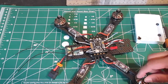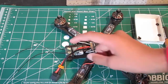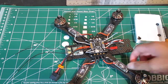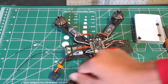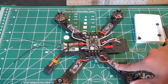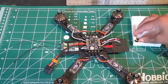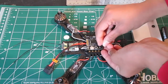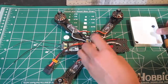I also heat-shrank my ESCs. I tested them using my receiver — I bound it using a separate power source from the ESC and a battery. I also checked the motor directions and all of them were the right directions. Then I went ahead and shrank my ESCs. That's the main thing that's different from what you may have seen in the previous section of the video.